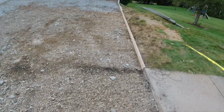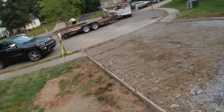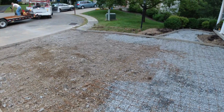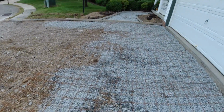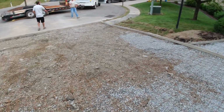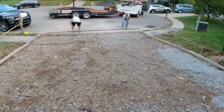And just putting in the reinforcement. On this one we're going to use wire mesh, 1/2-inch rebar, and fiber mesh. We're going over top of a water line that they just put in, so we want to bridge that real good. And then we're not going to run a spreader down the middle. Watch how we do our control joints in here. It saves us some time.